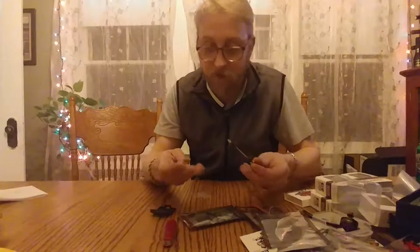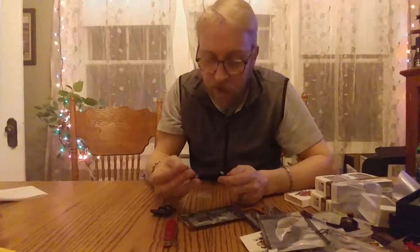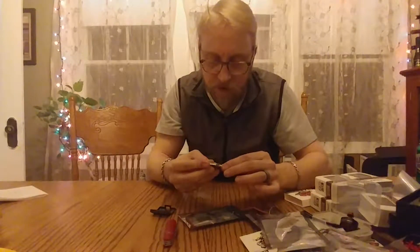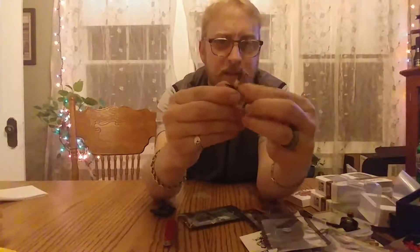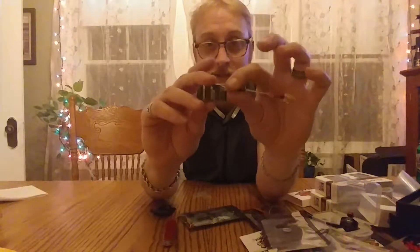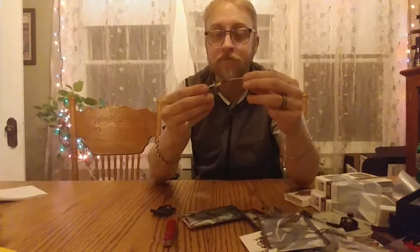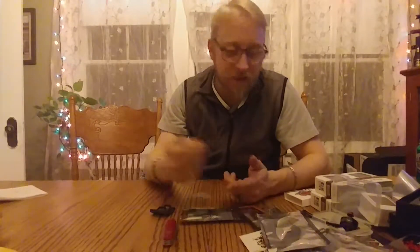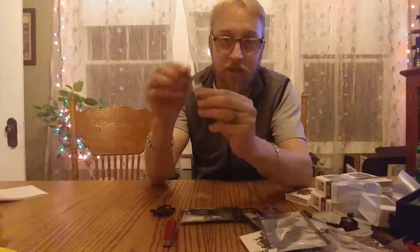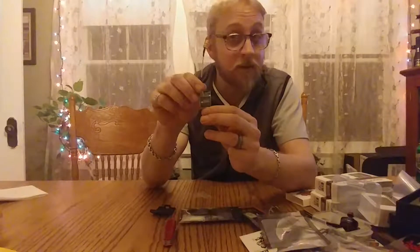The thing that really made Joshua excited was the MMCX connector - it's not the little rinky-dink IPEX snap-on coaxial thing. It has a more authoritative click and that sucker is in there - looks robust. I'm sure it weighs a little more than IPEX. I've heard from Trappy there might be some trade-offs, but I do like the connector. I've had IPEX connectors rip right off VTXs before - after you snap and unsnap it a few times they start getting loose and pop off and you've got to hot glue them.